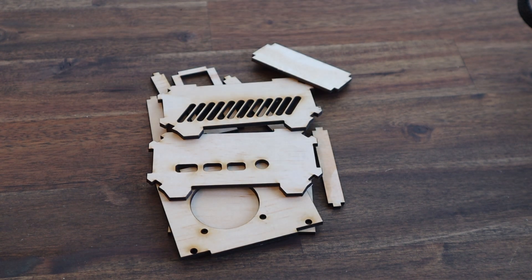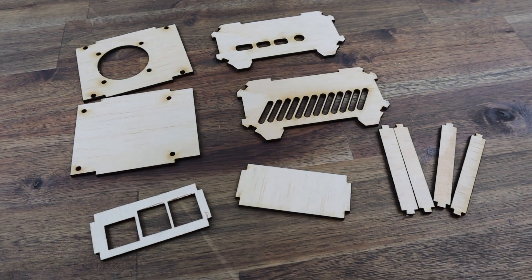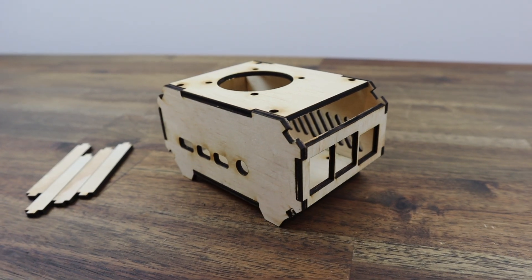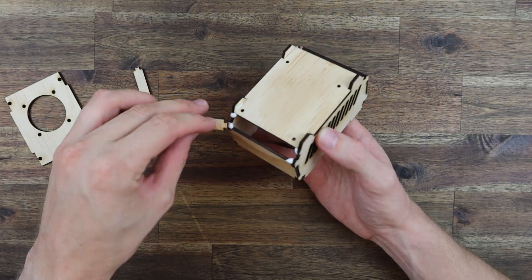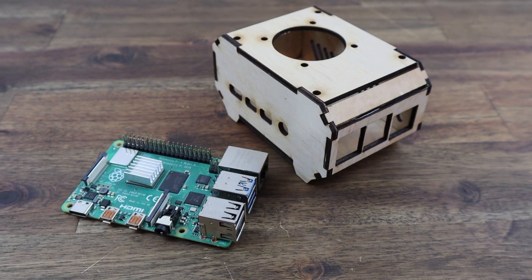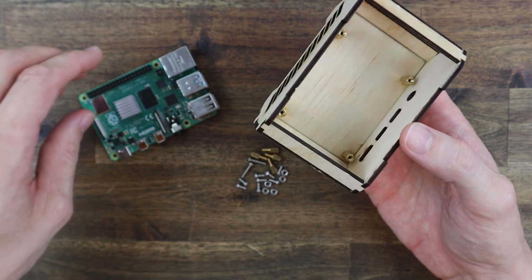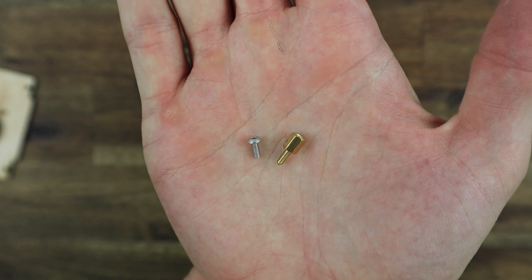With the case components cut we can now start assembling it. I'm using PVA wood glue to glue the pieces together — the tabs on each side hold them in position and keep the components square, so it's quite easy to do. I'm first gluing the four sides together around the bottom, using the top cover to help hold them in place without gluing it. Once the sides are dry we can add the 45 degree corner pieces, and that's it — the case is now complete and I can install my Raspberry Pi and fan. This is done with four M2.5x12mm brass standoffs and some M2.5 nuts.